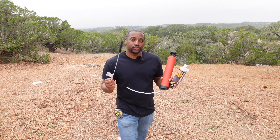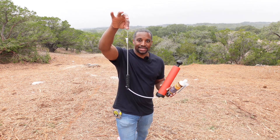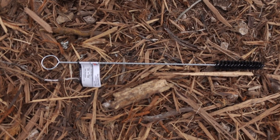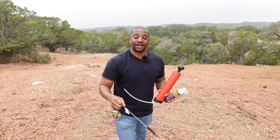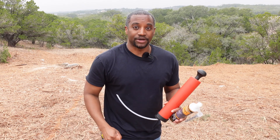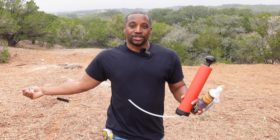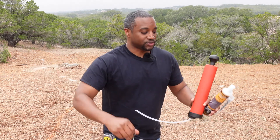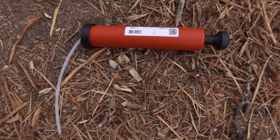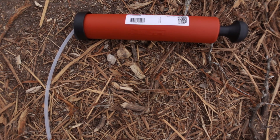The reason that we're only going to drill 16 inches into the ground is this. This is a wire brush — you have to make sure that all the debris you're bringing up with the rotary hammer drill is cleaned out thoroughly with the wire brush. And I have a manual pump that I'll use to clear out the debris to set the epoxy resin for our rebar to the foundation.